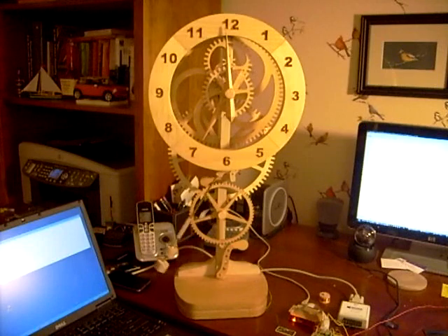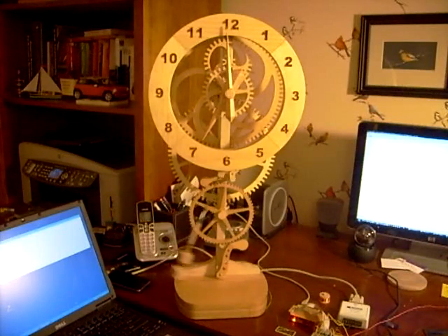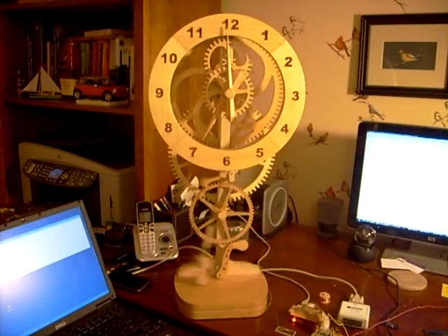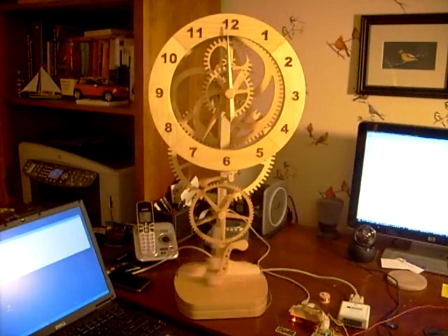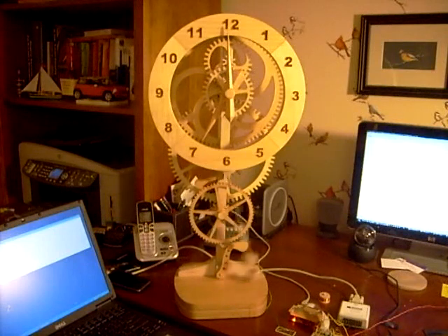You can see all of the moving parts of the clock are exposed and out in the open. The pendulum moves a pawl at the top of a ratchet wheel once a second, and that pulls the ratchet wheel a 60th of a revolution. There's a catch arm on the bottom to keep it from going backwards — that's what powers the clock.